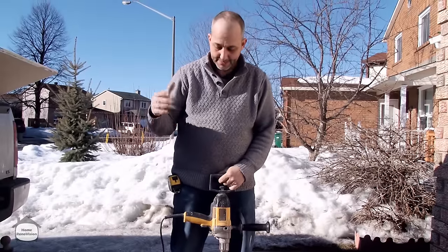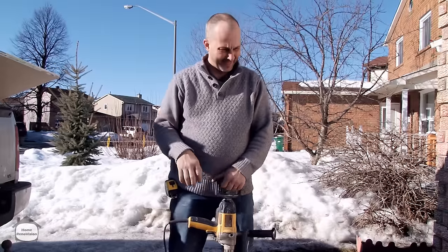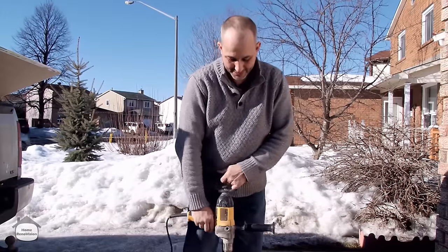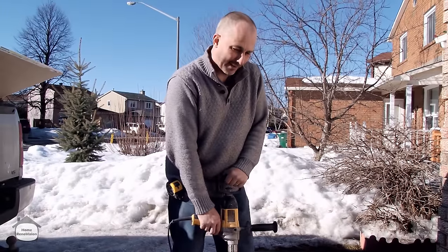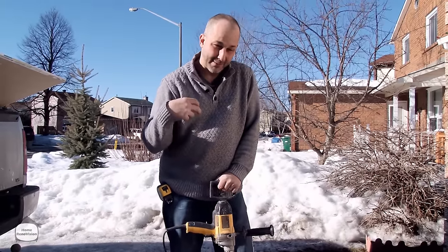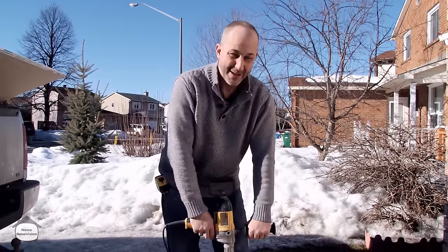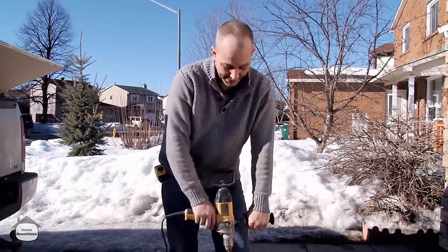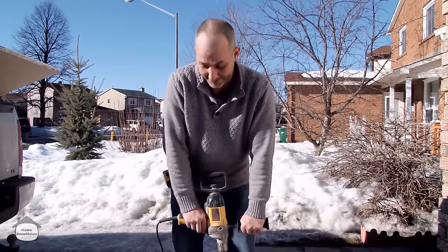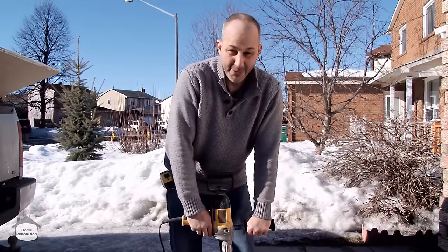Bottom line, guys, is the last 20, 25 years, they've modified cement, adding a latex polymer. And the idea is it makes cement act more like a glue. So in a lot of applications, that's handy, but depending on the products that you're working with and trying to combine together, adding that glue element can actually be counterproductive. It can make products not work. You can't bond certain things with glue to certain other things, but with cements, you can bond just about anything. So when in doubt, go with the old fashioned stuff, because the old fashioned stuff will still work with any modern building material, but the new stuff may not.